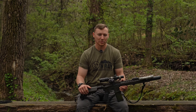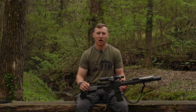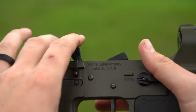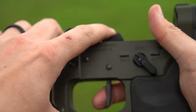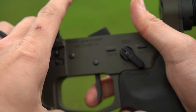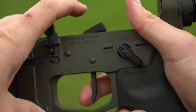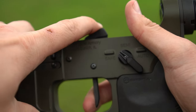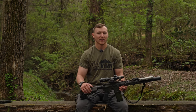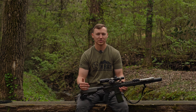These triggers usually pull about three and a half pounds, and that's not bad. But what's phenomenal about these triggers is there's no pre-travel — it's straight-up take-up. You're there at the wall. It's take-up to the break, then reset to the wall. There's no pre-travel, no over-travel, no excessive reset. All the movement is just what's required on these triggers, and that's pretty awesome when you think about how affordable these triggers are.